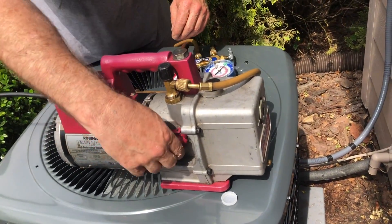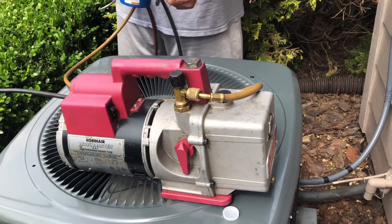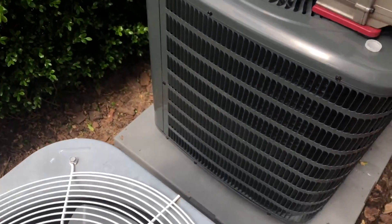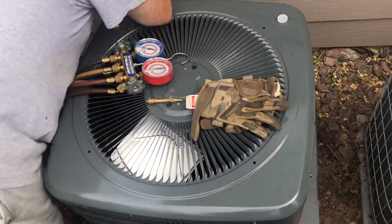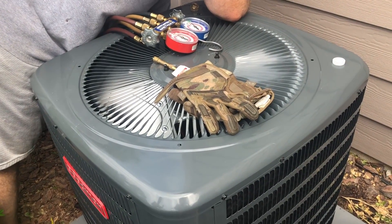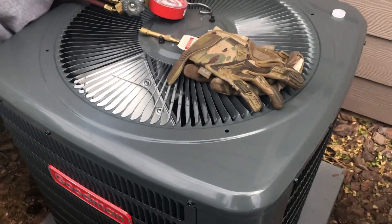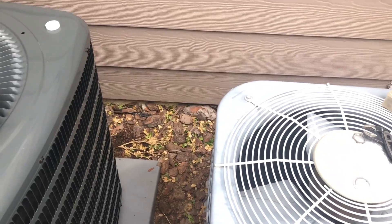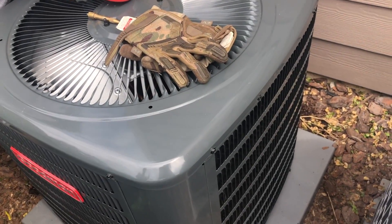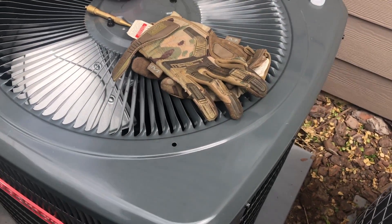Here's the new evaporator. What are you tightening up? I'm opening up the valves. You always take your gauges off when you start them, because if you have them on there when you open them up, the oil from the compressor — the initial surge — the oil goes into your hoses. And then when you go to take them off, the oil sprays all over every place. So I always take them off, start it up, let that oil get circulated, and then check it.